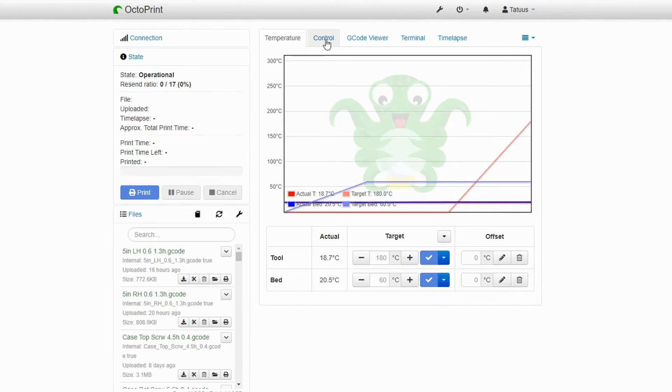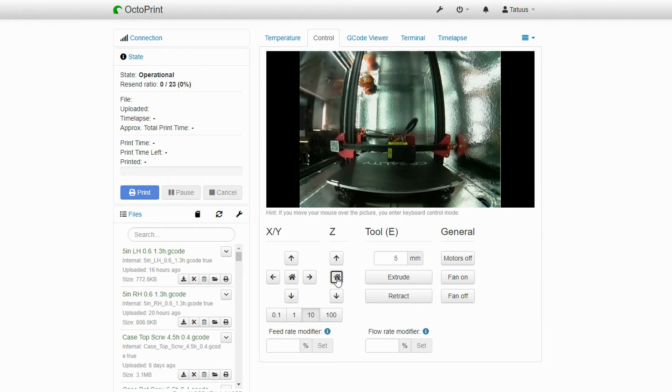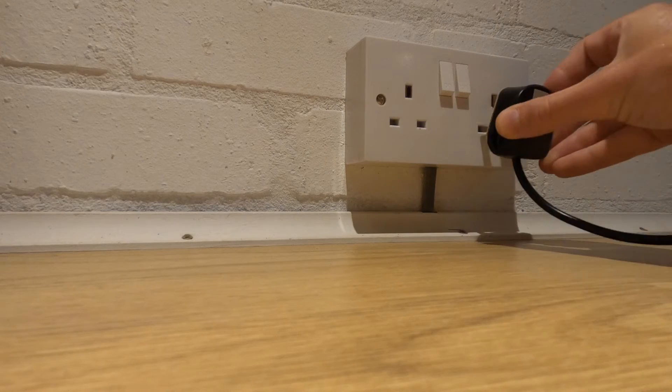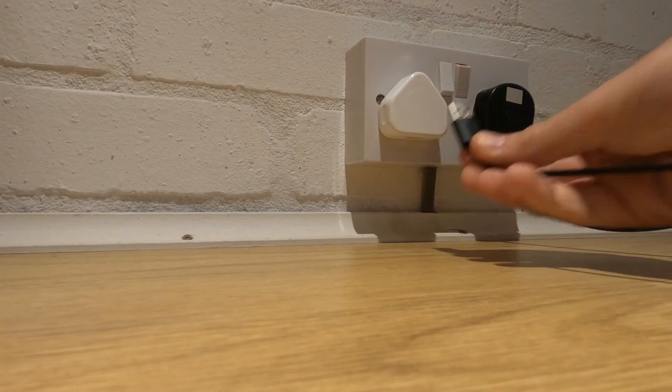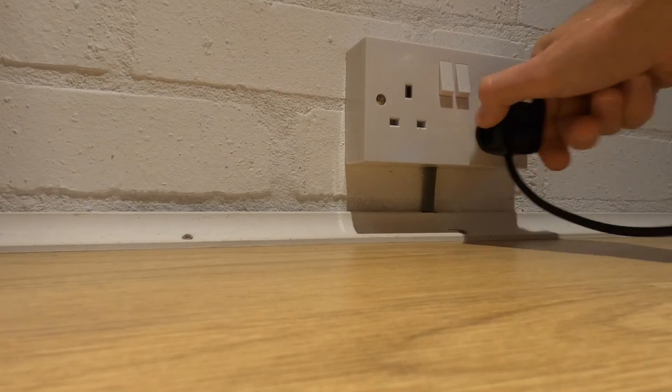It can enable you to turn on your printer and get everything warming up while you send it a G-code file, and you can even tell it to start your print. With a camera you can even watch your entire print remotely. Finally, plug in your mains plug — with mains switched on you should have no power supplied to your printer, and when you give 5 volts to the low power feed you should get power at your printer. If that isn't what happens, turn off your power and unplug both ends of your power lead before opening the case to check connections. With everything working correctly, your power relay is built, and in conjunction with my overheat safety circuit there's now an added layer of safety ready to shut down your printer before you even know there's a problem.